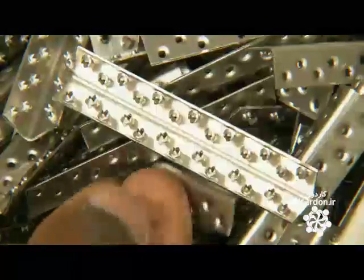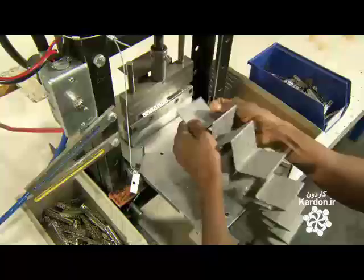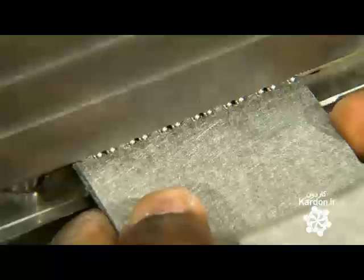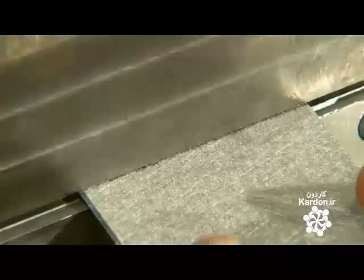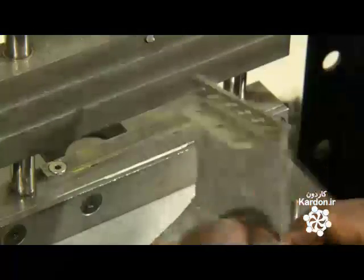Using nickel crimps, workers connect, depending on the filter size, up to 7 pleated strips per filter element. They press the crimps securely into the steel fiber with a press. They attach a different type of crimp at the far ends. This type has a tab with 3 holes for the electrical connections.